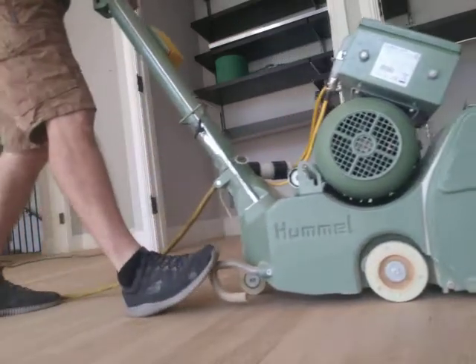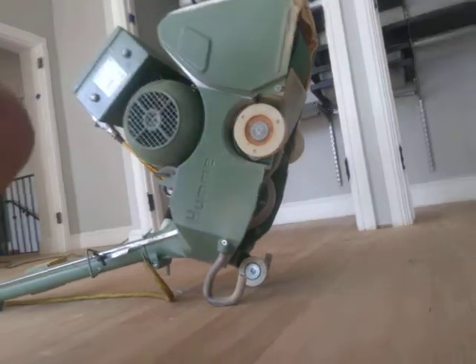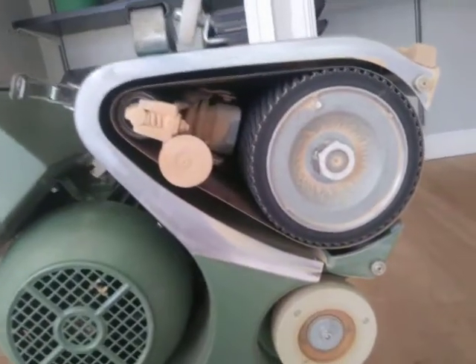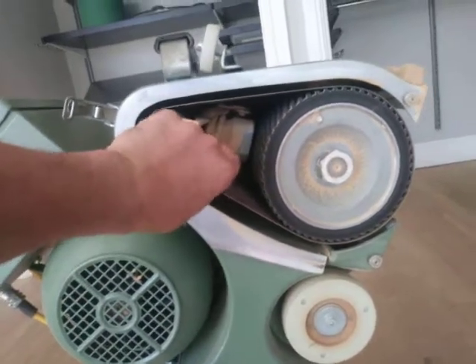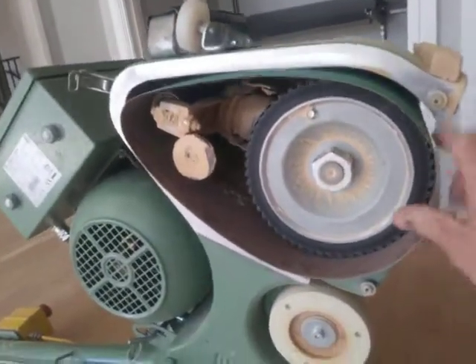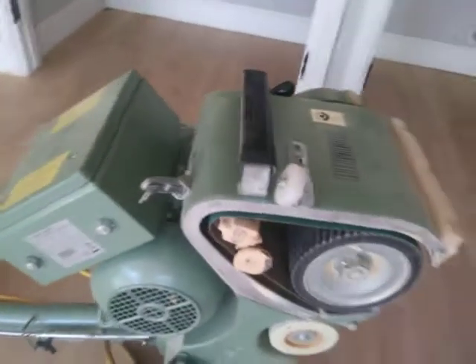If you ever want to put it down, just step on here and lay it down like this. Typically that's what you do when you're going to change the sandpaper — just unlock it from here. We replaced the spring about two years ago; it's dusty but once we blow it out at the end of the day it comes out like brand new. To change the paper, just lift up the lever this way and that loosens up the paper so it slides right out. To tighten the paper back up, just pull the lever down and that tightens it. There it is — beautiful Hummel.